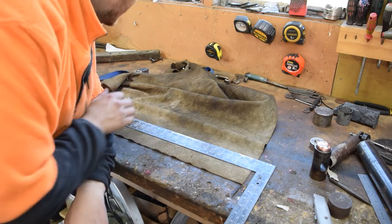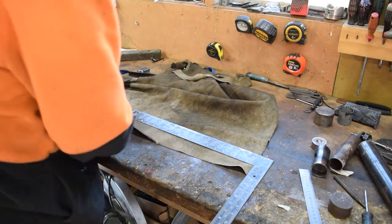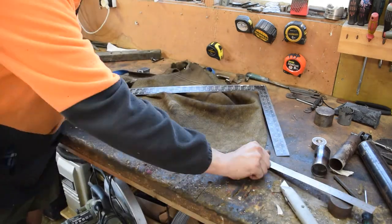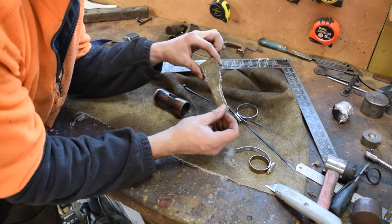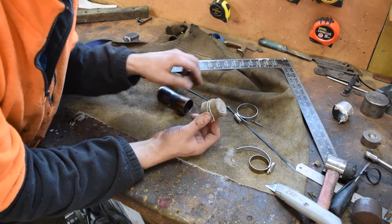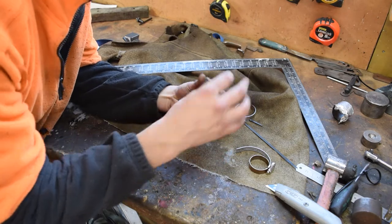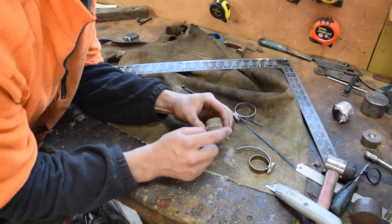I need a piece of leather and my leather apron seems to be on hand. The plan is I've cut the last edge down on an angle and we pull it round like so. The reason we've done that is so when it's in there, it's got no leading edge that's free. This is much harder to pull at — rather than if the flat top edge is just exposed like that, it's just going to pull and tear. So we just want to try and tuck the edge down.